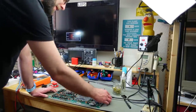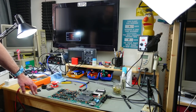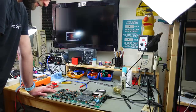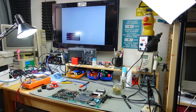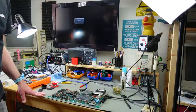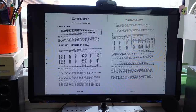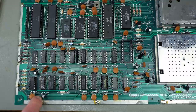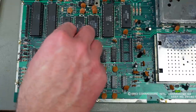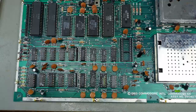We're getting consistently eight flashes now. Since the multiplexers are good - we just replaced them - this indicates a failure of RAM. Eight flashes on a Rev B Commodore 64 indicates U21. Unfortunately the TL866 EPROM programmer doesn't support checking RAM chips, which would be a nice feature, but nobody really uses these kinds of dynamic RAM anymore except in the retro community. Since it's all empty RAM that I'm going to replace anyway, let's desolder U21 and see if that's the culprit.